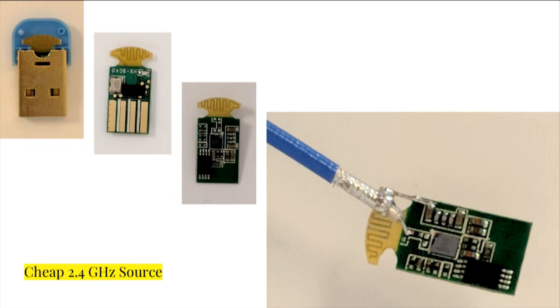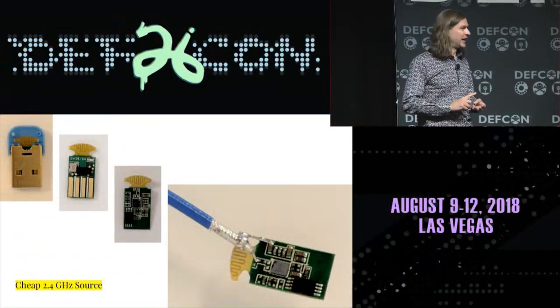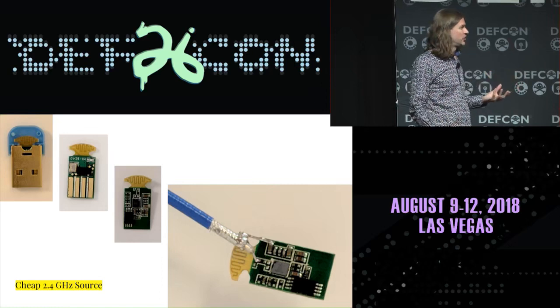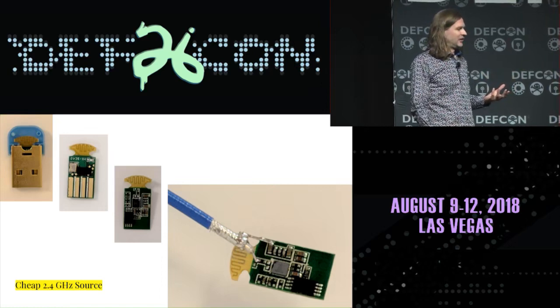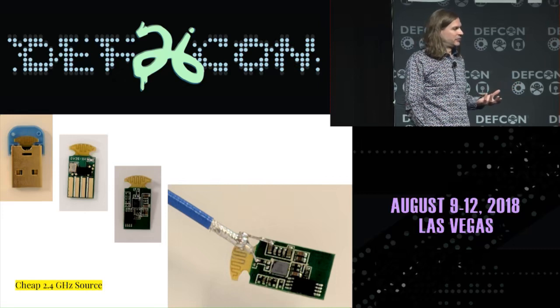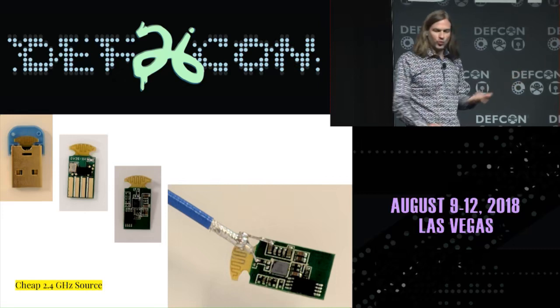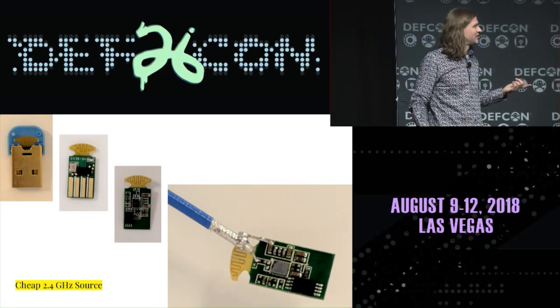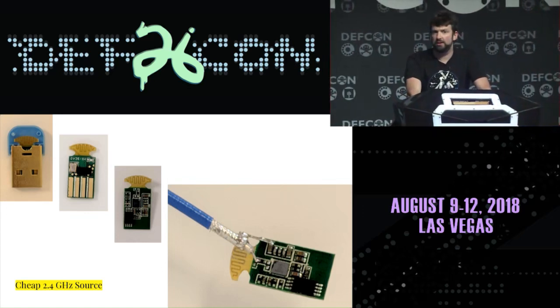And I want to point out that this isn't one of these sophisticated modern Bluetooth chips that knows how to do Bluetooth and FM radio and Wi-Fi and Bluetooth Low Energy and all kinds of different protocols. This is a 10-year-old chip or more, that we were hacking on in the early days of Bluetooth hacking. One of the pieces of code I'm going to run in a minute in the demo was my first ever open source contribution, which was to enable the radio test modes in these dongles.